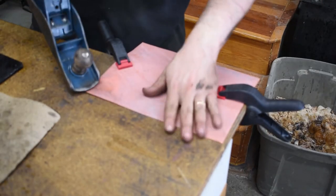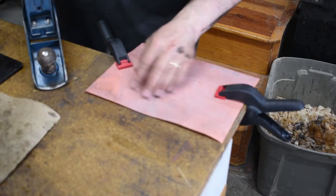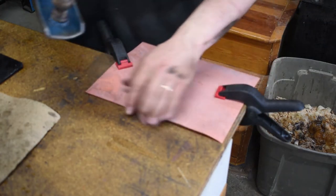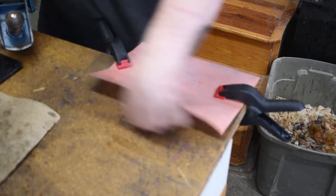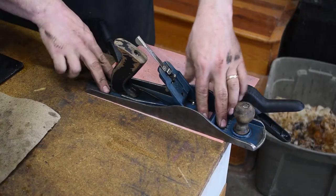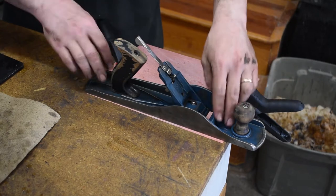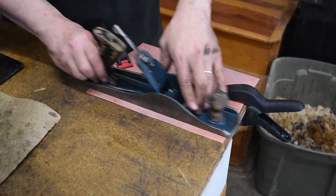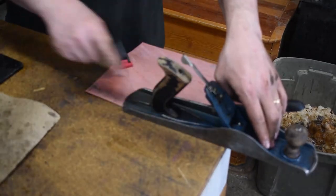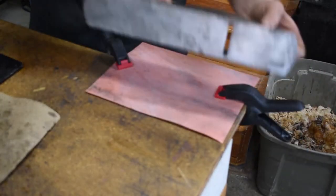What we're doing here is using 120-grit sandpaper to try to flatten the bottom of this. You want to do this on a surface that you know is really flat — this surface should work fine. I'm going to hold it down evenly; I'm not going to hold the handles, just hold it down. I don't want to push too hard — from what I hear, you can warp and bend these.